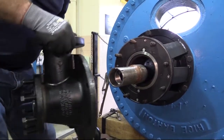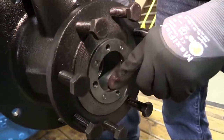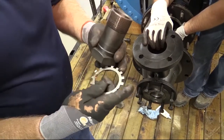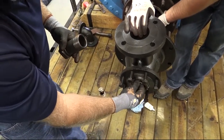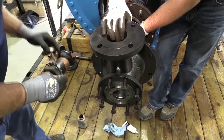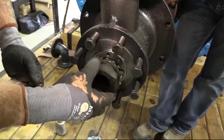Position the body over the support tube, making sure that the slotted grooves in the support tube are aligned and fit into the pins in the body socket — there may be one or four pins in this location. Position the tab washer onto the hollow bolt so that the bent tabs will be pointed towards the body. Lubricate the threads on the hollow bolt with never-seize and then thread it onto the support tube.